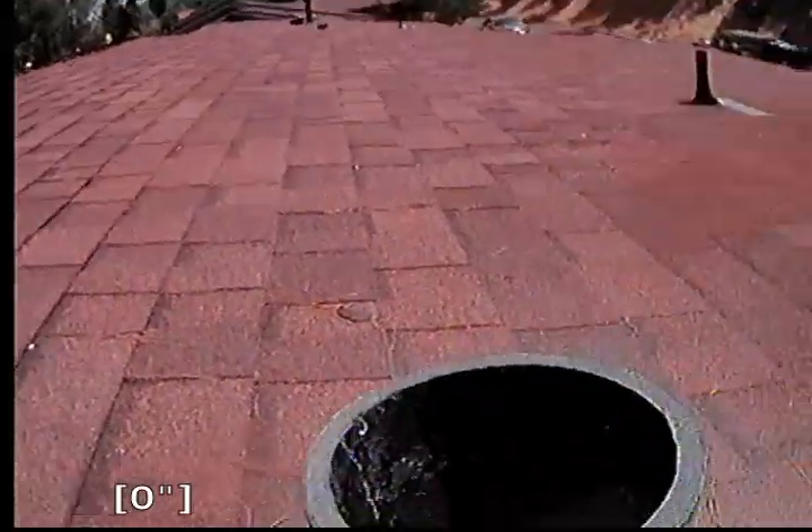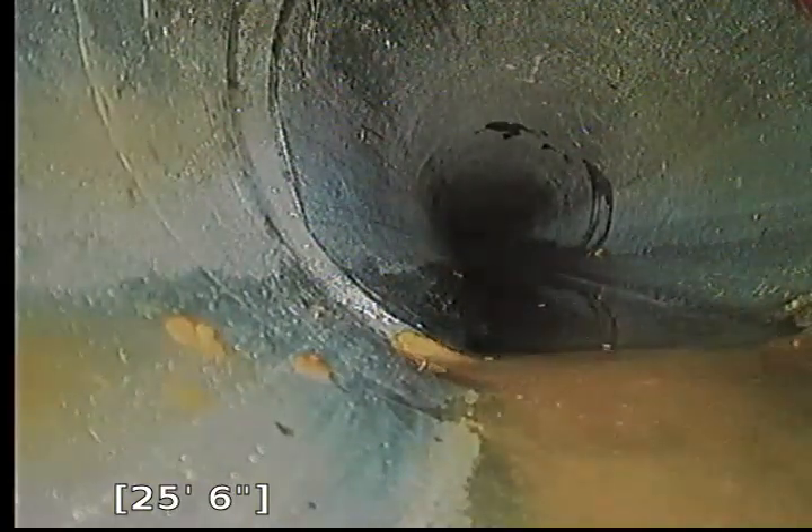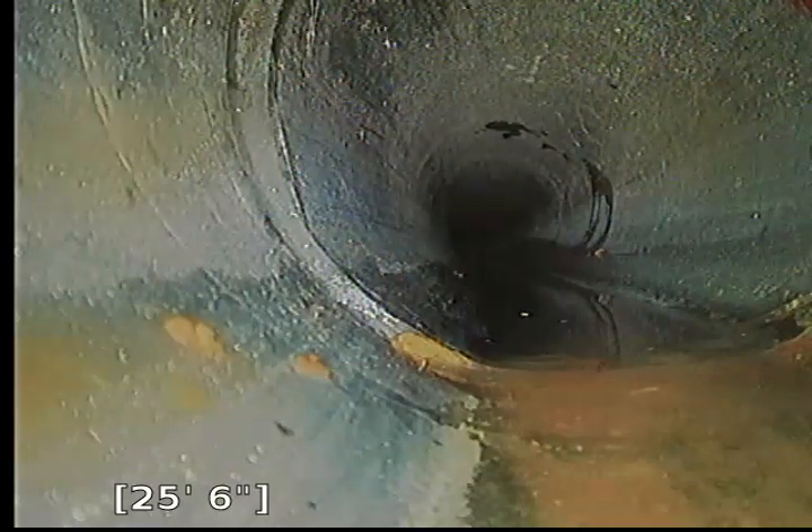We moved over to the other part of the roof, closer to the front of the house. We have our two-inch vent here — this should lead into the laundry. It only needed to be an inch and a half, but they just ran two-inch. Going down this vertical: here's our two-inch entry point. The trap and trap arm enter right here inside the wall. The laundry's in the closet inside the house and goes vertically down a little bit more. Here's the 90-degree turn and sweep, now running horizontally across. Looks like some wood chips here from construction debris — somebody didn't cover up the pipe when they were drilling. That goes in, and there we go — the laundry has a clean junction across into the system. We're now back in the main sewer. The laundry is okay for the drain line.